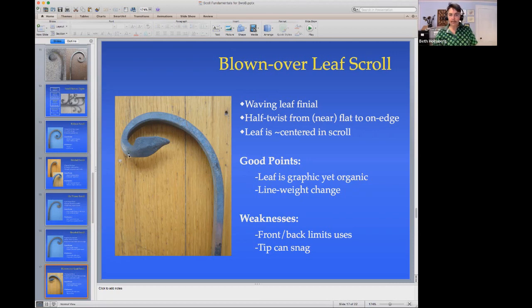So you can see how narrow it is here. This bar is, I think, 20 millimeters wide. So I've brought it down to about half of that for the stem, maybe a little less. And you need to make a very tight bend there when you start it. But when we're talking about what makes it good looking, I would say this one's almost good looking. Fairly tight here, maybe a little bit more negative space in there. And then if this arc matches this arc on the top of the leaf or the bottom of the leaf through this section, that looks pretty good.